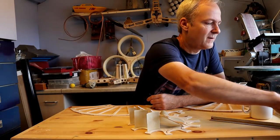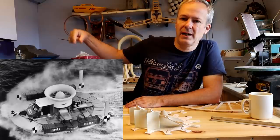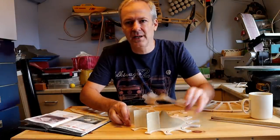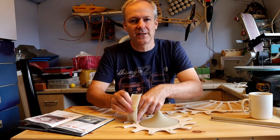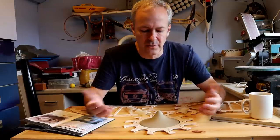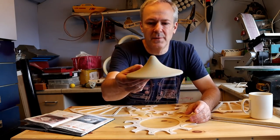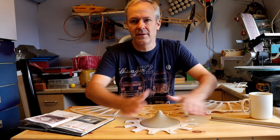If you don't know what this hovercraft looks like, it's based on an early model — the SRN-1. I've put a picture here. So the air gets blown down into the hull. The next problem is I've had issues in the past where you blow air down into the hull and if it hits a flat surface at the bottom it kind of crashes the air — you lose quite a lot of the pressure or the flow. To stop that, I've got this curve here that I've turned up on the lathe, so the air is going to blow down on that and then curve nicely all the way around that form.